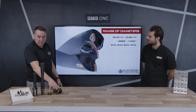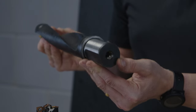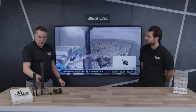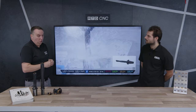The APX is for deep hole, large diameter — say 95mm up to 8 times D. So any of your housings, pump housings, large blocks of material where you want to use a roughing hole to start and then follow with either turning or boring operations. This is a tool that really removes a lot of material and has a nice open chip flute for chip evacuation. General purpose drill, large holes, roughing solution — that's where to start with this one.